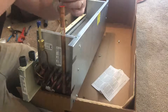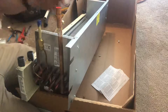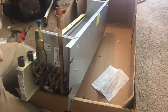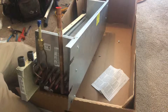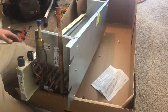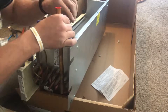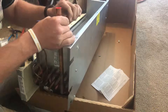Whenever you're installing a condenser, you always want to remove all the rubber plugs and caps because they'll melt. I also find that sometimes there can be burrs in there, and you want to make sure you get all the burrs out. You want to make sure you don't have any burrs in your way because if you do you're going to have a heck of a time installing it. I go in until it bottoms out, then back it out.